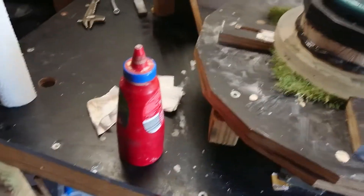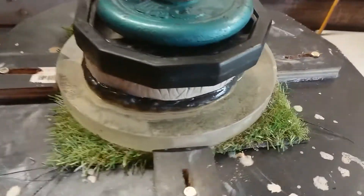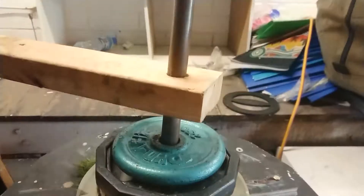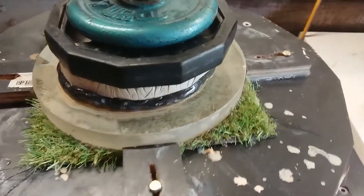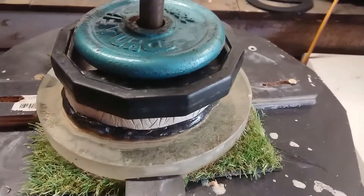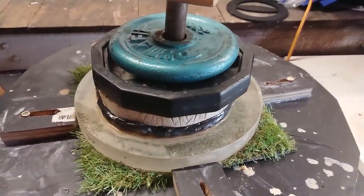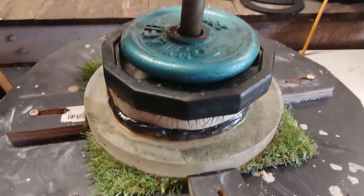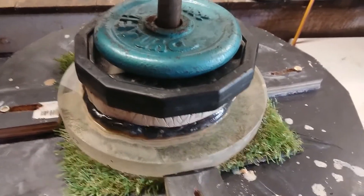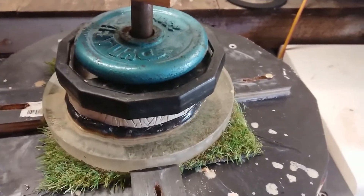This is my routine before polishing. I've covered the mirror in cerium oxide — at the moment I'm using a pretty thick slurry, as you can see. I've attached it to the arm to make it easier to swing the arm out of the way, and I'm pressing using five kilograms on the pitch lap. I'll leave this for about ten to fifteen minutes, then I might brush it up a bit more, fix up the channels if needed, and then start polishing.